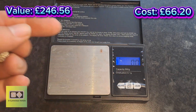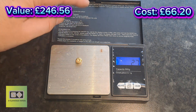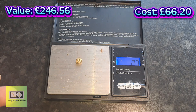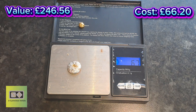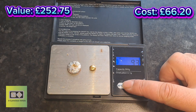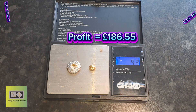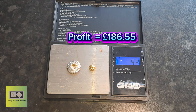Here's the gold and the silver from all that 20 kilos we originally started with. We've got 2.7 grams on the gold, and a little tiny piece here — there are a few bits left in the melt dish we'll get later. And 6.7 grams on the silver. So all of that small material I never normally bother with was a complete waste of time really — it cost me about £40 in nitric acid to recover £6 worth of silver. I do think it would be better smelted — save a lot of it up, smelt it all — at least you can see what you're working with then. Thanks for watching, and thank you to the 3,000 people that have subscribed to the channel — really appreciate it, I'll see you on the next one.